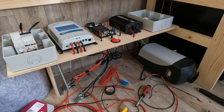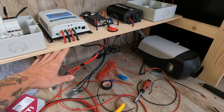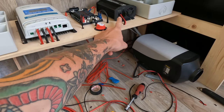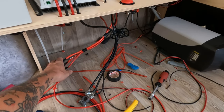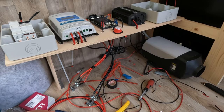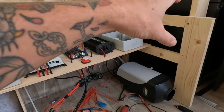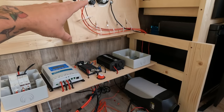I'm just connecting more and more wires, continuing from yesterday. We've now got all the ones coming out of the main battery switches, the solar charge controller, the solar fuses, and also the AC charge controller all running down to the positive and negative battery terminals. Now it's just a case of taking all the wires coming from different points in the van — the lights, fridge, pump and whatnot — and wiring them into the fuse box, and most of them also have to go through switches.